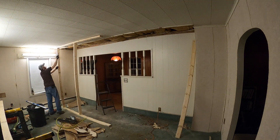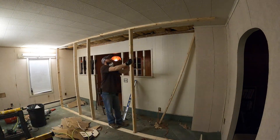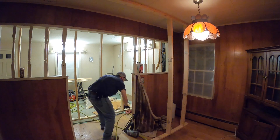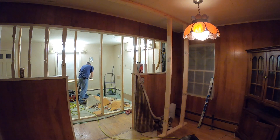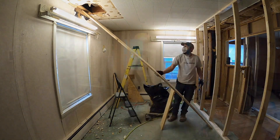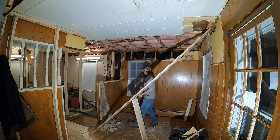When you start the job, the first thing you want to do is support both sides of that wall, because you're going to be taking that wall out and you want to support what's there already. You want it close to that wall but not so close that you can't work, so make sure you give yourself enough room. I actually used two springboards in the center of the room to attach to the outside wall down to the floor. It's not 100% necessary, but the reason I did that was because it was wintertime, there was a snow load, and I didn't want the roof load to push those outside walls out at all. So as a precaution, I used those boards to keep the outside walls exactly where they were. Once you have each side of that wall supported, you can go ahead and remove that wall.